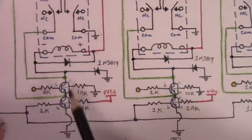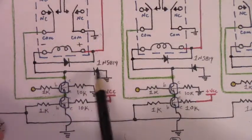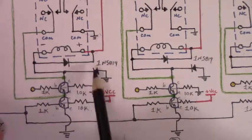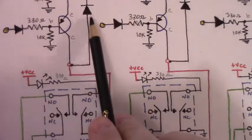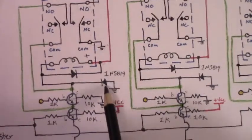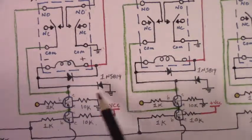We can take care of these connections to the right-hand side of the NPNs we just added. This is just an extra protection diode in case the first diode misses some of the voltage spikes — this one can catch them. If it happens to go to negative voltage, this one can catch it before it goes through the PNPs. This diode is probably sufficient to protect these NPNs, but adding this second one won't hurt a thing. If it protects, great; if it just sits there and does nothing, that's okay too.